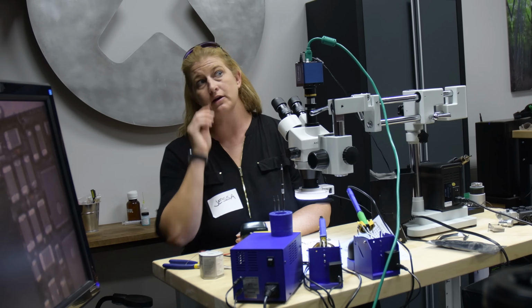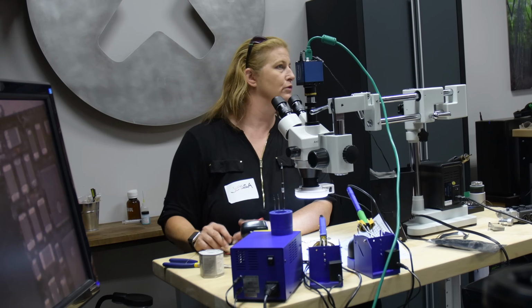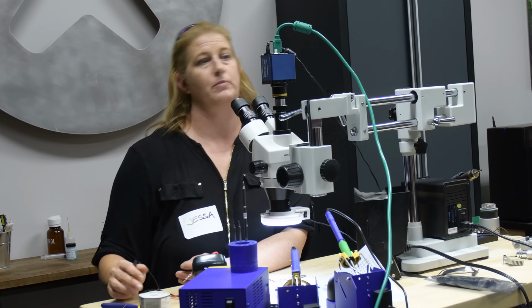Now, if something is a wire to ground, is resistance high or low? Low, exactly. It'd be like 0. Resistance to ground would be 0 if a line was a wire to ground, meaning a short to ground. It had a short circuit path to ground.